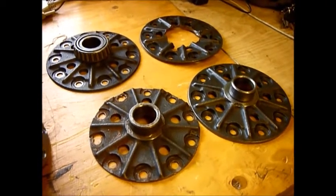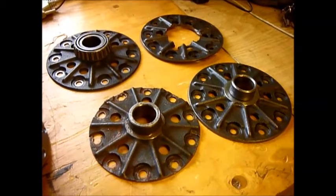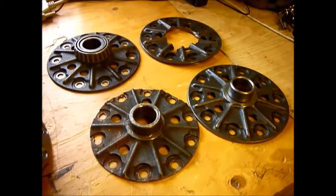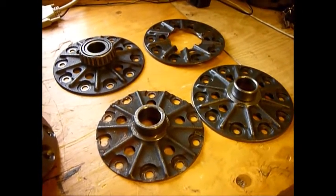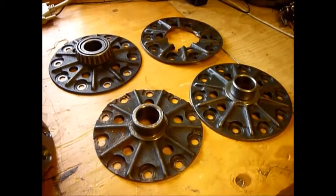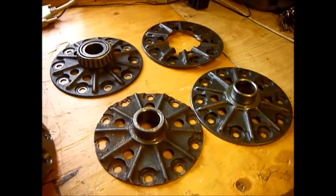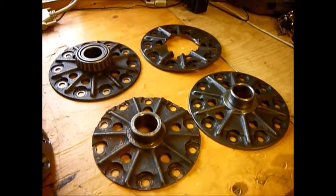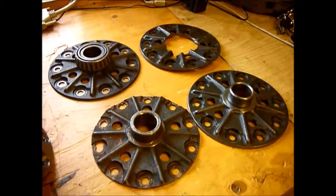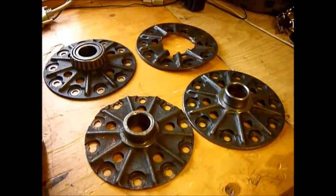The early RD03s and RD56s - as previously shown in videos - have a plastic centre cage. These do break, but in general terms the earlier ones are a little bit better than the later ones, because the later ones have an even worse air system and also suffer from some idiot redesigning them so that the copper pipe goes over the top of the crown wheel, which means if the copper pipe touches the crown wheel it will chop it in half and you're into some serious money to repair it.